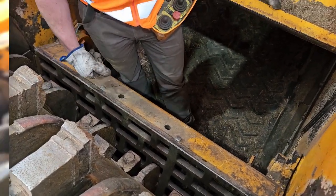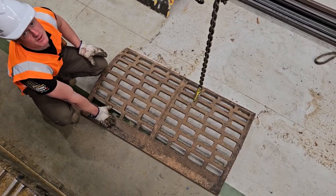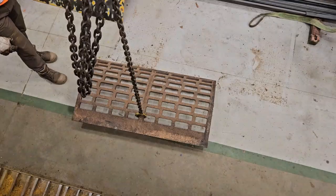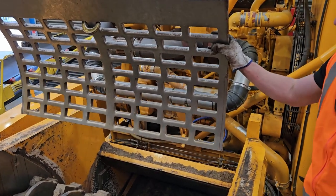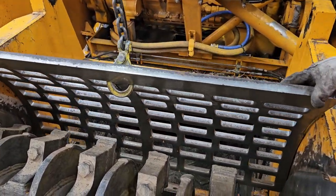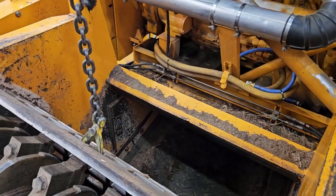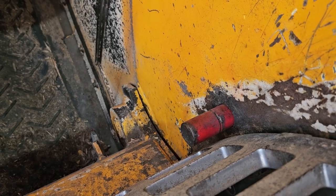You can feel it seating nicely in the grate frame. When connecting up the top section of the grate, note the wide part of the grate with no holes in it goes at the very top. Secure your hook at the centre at the top, then gently lower the top section of the grate into the hog box, lowering it until the two sections of the grate are touching each other. Before removing the lifting apparatus, ensure that the safety pin is replaced back in.